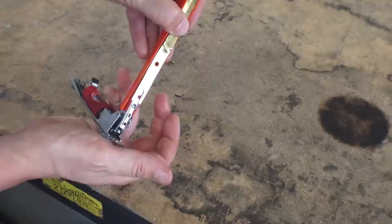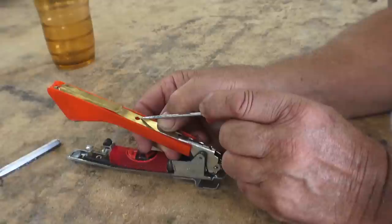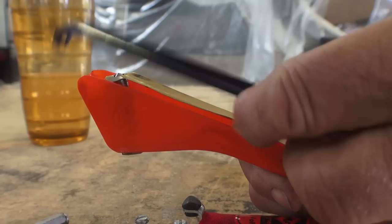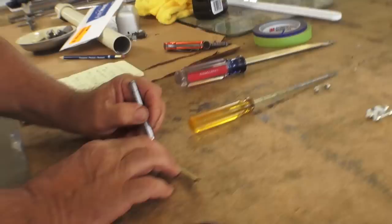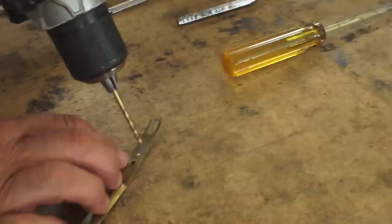Make sure you line up your holes and hold the bulb in place. Put the top piece on and everything has got to line up with the screws and the nuts. Here's where we ran into a problem with this bulb — the holes do not line up on this particular model semaphore. When we pull back to line up the holes, the brass piece holding the bulb moves upward above the lens and we can't get the top on. Looking closely, the aftermarket flasher bulb is actually a little too tall — just a little bit longer than it's supposed to be. For late model semaphores it might work, but for earlier semaphores like these, you may run into the same issue. The fix is to just drill a new hole in the brass holder.